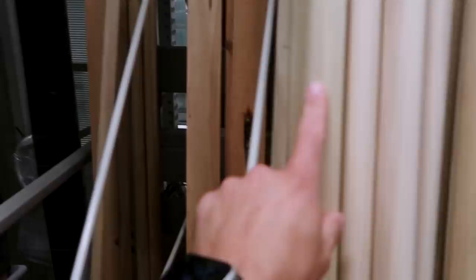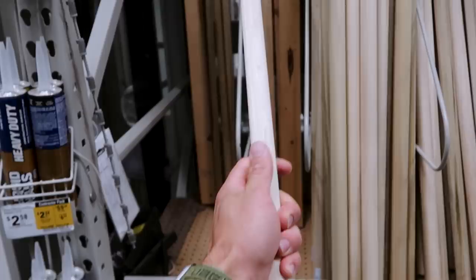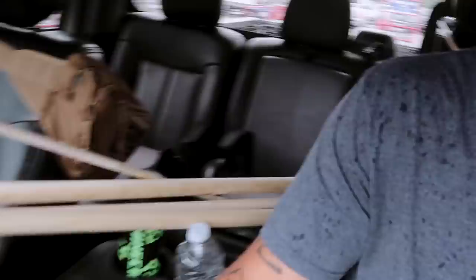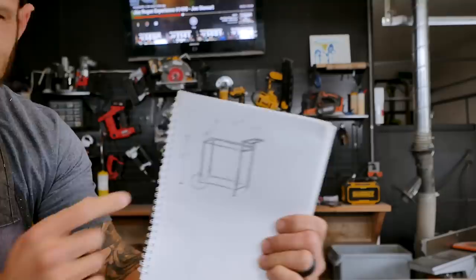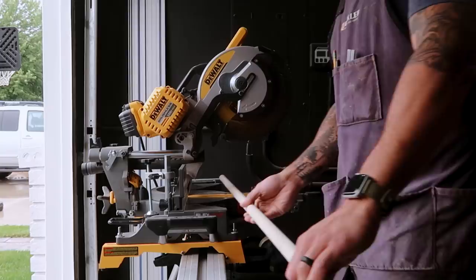So we have a unique approach here. We're going to have these dowels — these are your classic closet stuff, inch and three-eighths and one inch thick. I drew up a rough sketch of what I kind of want this cart to be. Very simple design. What I'm going to do is create miters, put them together, wood glue, and then screw it in and cap it off with some wood filler or caps. I'm going to do the top shelf, the bottom shelf, and then reinforce it down the middle.